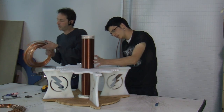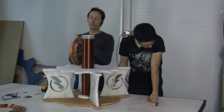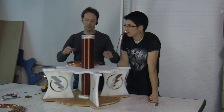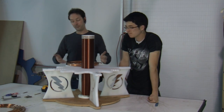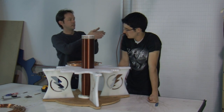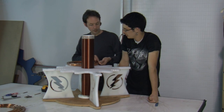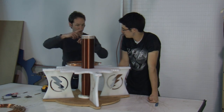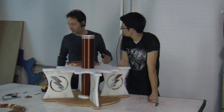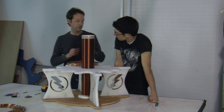So we're going to put a little bend in this. Do we have one of those spring benders you use for bending brake lines or refrigeration lines? You realize this is refrigeration tube, right? You can bend it easy, but if you want to put a nice pretty 90-degree bend in it, bend it over a drill bit — though I wouldn't do it over something with that small a radius. We could bend it over that handle.